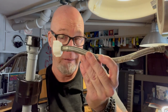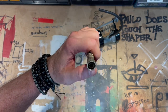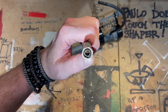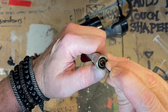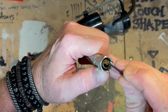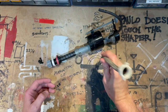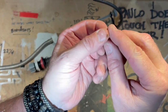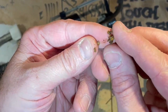So what was the problem? I'm thinking it's this one here — let's take a look. Right here: debris. You'll find this rusted, crunchy pebble and metal gunk usually at choke points in your plumbing, or in strainers, cartridges, and aerators. Unscrew the aerator on a faucet and you'll find lots of little trapped debris. If it's brownish or reddish, it's oxidized iron; black is oxidized manganese. Sometimes when there's been plumbing work done in your home, your building, even your neighborhood, small chunks get dislodged and eventually wash downstream, becoming trapped in places like this.